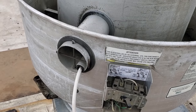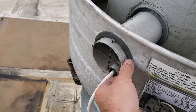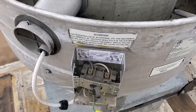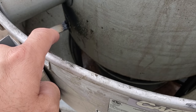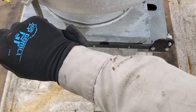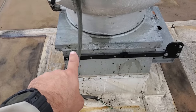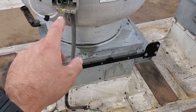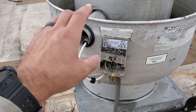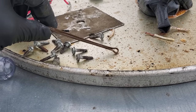From the looks of it, I'm going to disconnect this electrical, get this breather port right here off, and get the cotter pin out. This assembly is probably going to have to come off and we're going to have to pull these arms — they're going to have to be loosened. Whether we can pull the whole thing as one assembly is what I'm thinking. When you're doing stuff like this, you have to think of the worst case scenario. You're just using mechanical common sense.